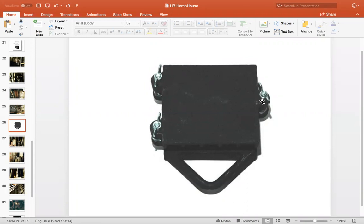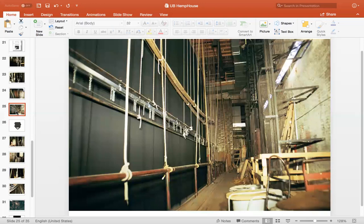Miguel had a question about how you feel about tying off to the handrail instead of a pinrail. Not a big fan of that, no. Who knows what it's rated for? Exactly. But I don't know what it's holding either. It might just be a loose piece of rope that's tied off there so it doesn't get in the way. That may be true, but one of the things about rigging that is important to me is developing good habits, and those habits need to stick with you. You don't veer away from those habits without stopping to think about what you're doing.